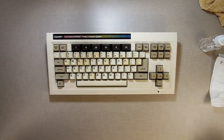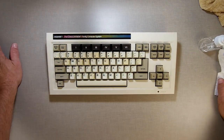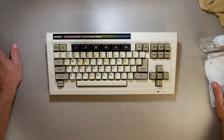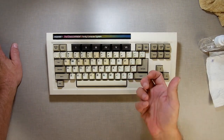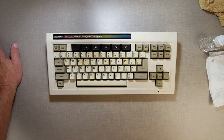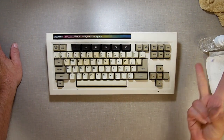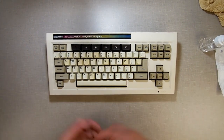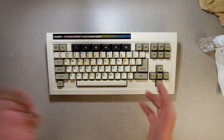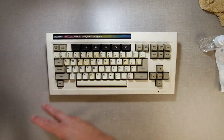I got them. I tested the first drive. Every drive I got, I took apart and cleaned and then put back together. My first thing I did, I just do the shake test, make sure there's nothing broken, and then I plugged them into the power supply I had, and two of them lit up and worked, two of them didn't. I took the two that lit up and turned on and cleaned them out inside and out and tested them. They worked great. So I had two drives there, and I made back my money with those two.